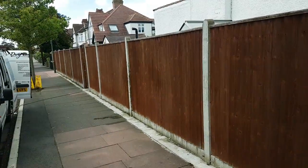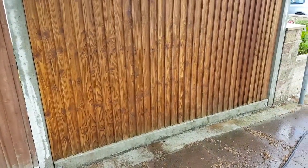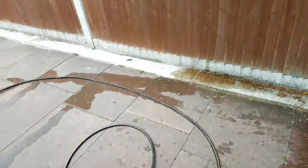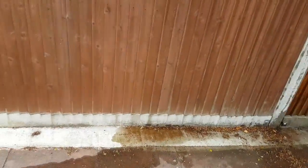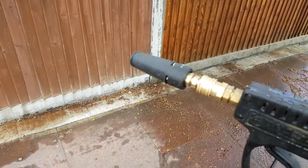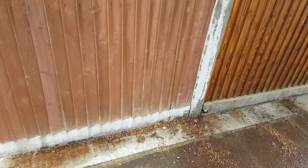So there's the fence — you can see all the way down there. Here's the one I've just pressure washed gently; I just removed most of the old stain. You will get a bit that sticks, especially in the grain, but I just want to show you how easy it is to do. The jet wash is on quite low power, just off idle, because you don't want it too mad. I've got my hand lance with a vario nozzle on the end set to quite a wide angle spray, and I'm going to try and do this one-handed as usual.